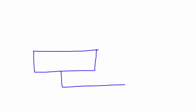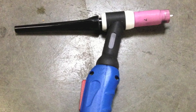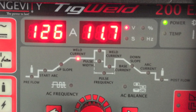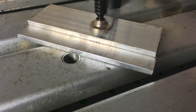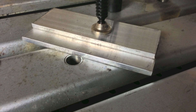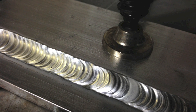The weld we're about to make is going to be two overlapping plates with a fillet weld put in on the arrow side. Using the torch provided, I set up a number 7 cup and a 3/32 tungsten. I set the machine to about 125 amps, then clamped down a lap joint to the tabletop and made a first pass using those settings. I used a 3/32 4043 filler rod.